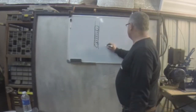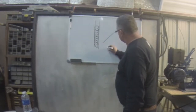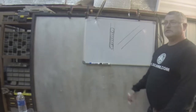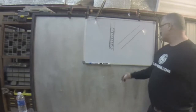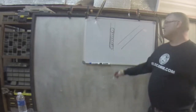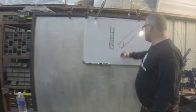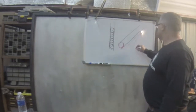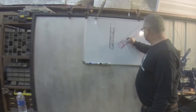I'm glad they've got these little dots on there. In any position of the weld, if you can keep two parallel lines — whether you're MIG welding, TIG welding, stick welding, any kind of welding, brazing — you're basically going to have the same weld puddle. You're always going to have a weld puddle, and you're going to have a direction that you're going, and your bead going.